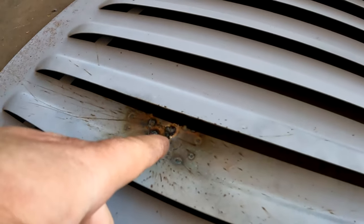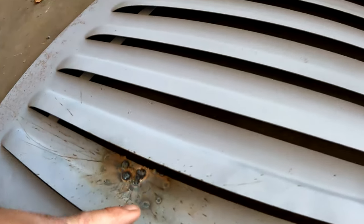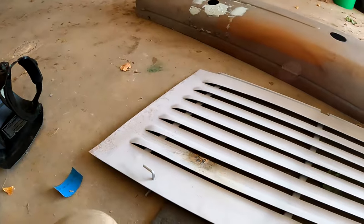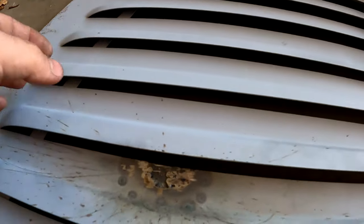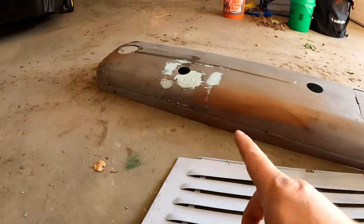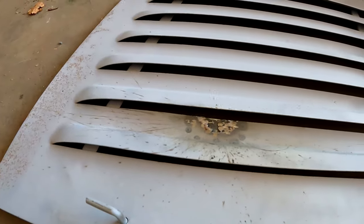What was happening on that part there, it was melting away, it was thin. I think I'm gonna put a little bit there yet, maybe there. So I'll do that and come back. All right, so I cleaned her up with the grinder. So it's pretty much flat. So next coat of body filler, I'll throw some on here and I'll get this caught up.